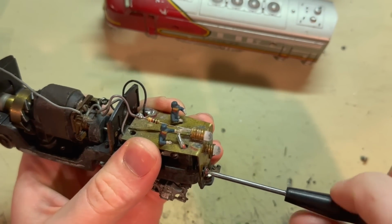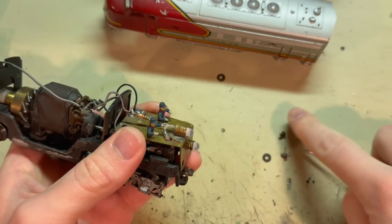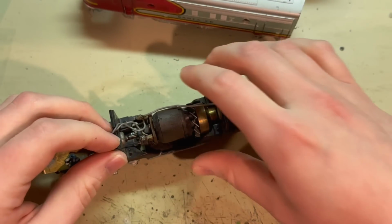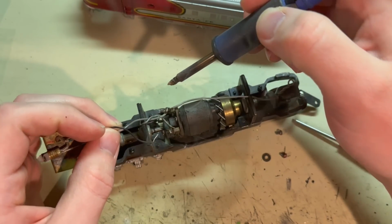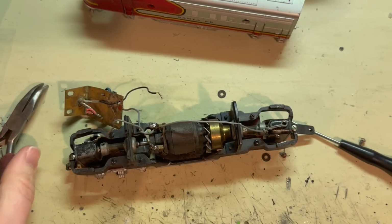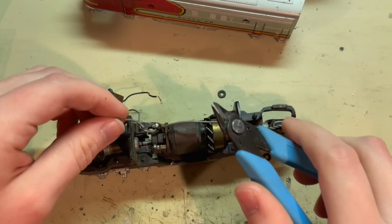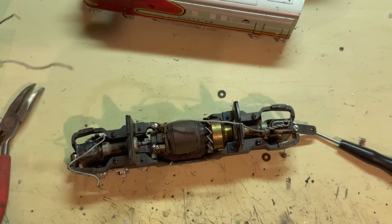Let's see, I'll just take off this front plate here. Okay, just a couple wires holding that. So I'll remove that entirely for now. Come on. That wire must be wrapped around there. This looks like original factory wiring here, and it seems like it was really thoroughly wrapped around those contacts, so I'm just going to clip that off actually. There's plenty of wire left, so I can just do a bit of stripping from the wire and then resolder it later. It'll be totally fine.